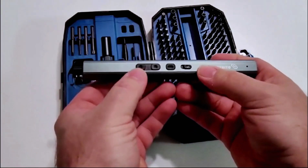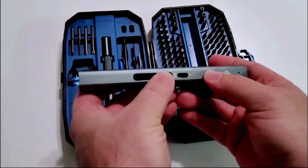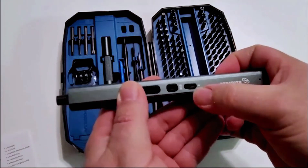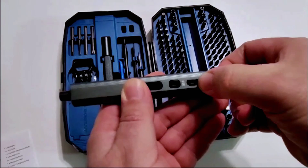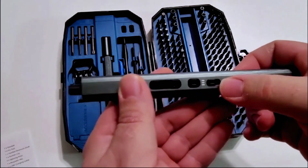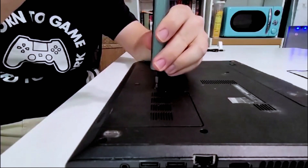There are a couple of buttons here: this one is to screw in and screw out, this one is for the LED, and this switch is for your torque settings. Right now I'm on 0.15 — the middle will be 0.35, and all the way to the end is your maximum at 0.7 newton meters.